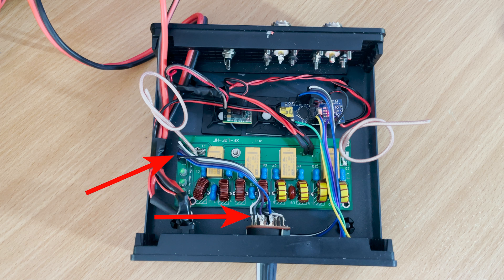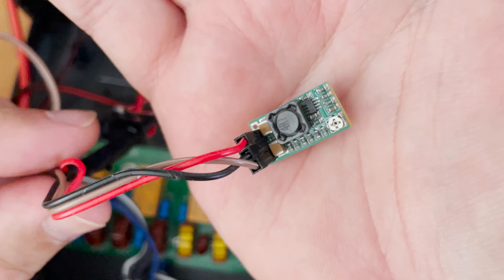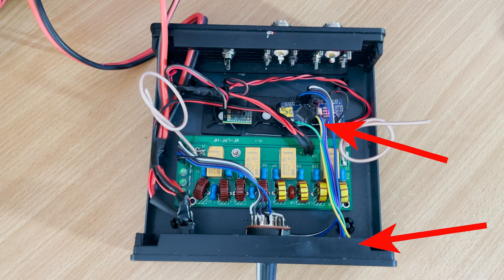Essentially we have five wires going from the left side of the filter board to the rotary switch. We then have a further five wires going from the rotary switch to the input signal pins on the Arduino — four of those wires are for signal and the fifth is a ground. The filter board is powered by an external 13.8 volt power supply, but as the Arduino Nano only requires five volts I use a mini voltage regulator to step down the 13.8 to five volts. We then have a set of four wires going from the Arduino Nano to the OLED screen, providing power and data to control what is shown.